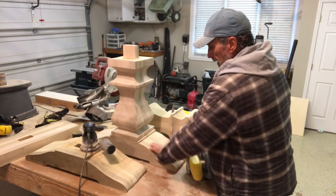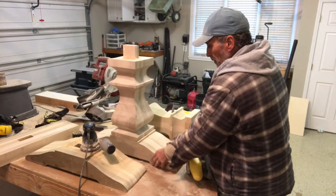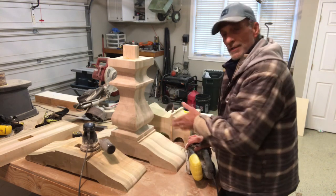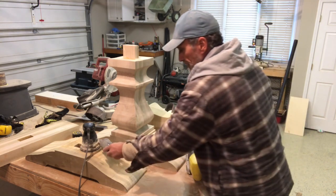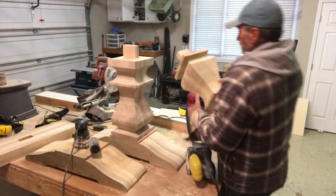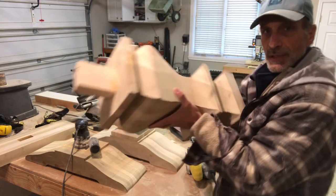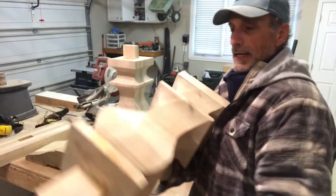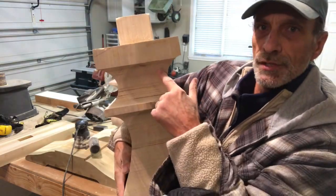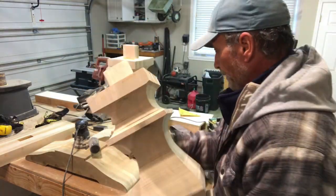If these weren't on here — you can see this one here — both with my belt sander and a little bit of the orbital sander, there is a lot of sanding involved. You can see here, I just cut this on the bandsaw and cut my pedestal. While the pedestal is cut out real nice, you do get a lot of ridges — you can see those cuts as you turn your blade — so finish sanding is needed.